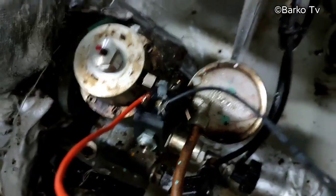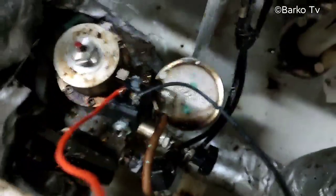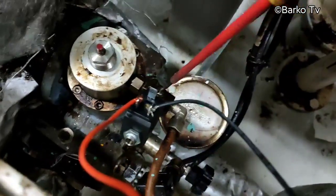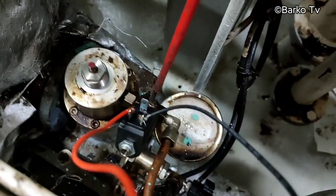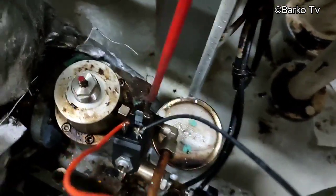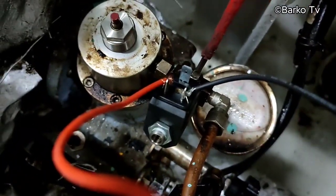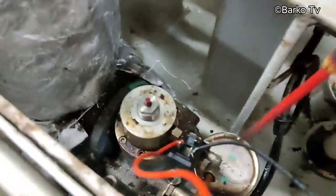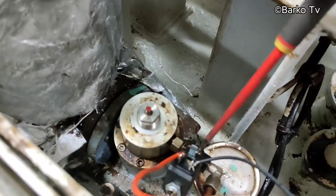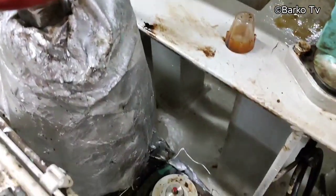We put in an external power supply, because when I check the power supply going to the solenoid valve, if activated, it has a supply, but right now I need an external power supply so that I can simulate. And then we do a manual test, manual for the pilot solenoid valve of that main three-way valve. But unluckily the main valve did not open and close.